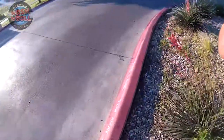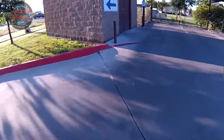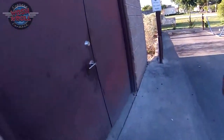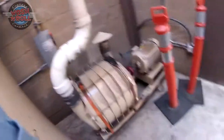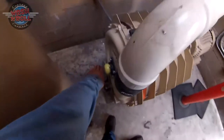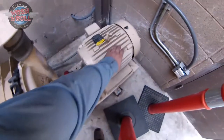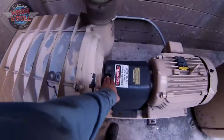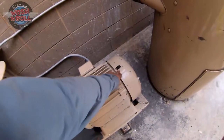Most of the greasing can be done bi-weekly, but this final greasing needs to be done weekly because of how much they run — these are your vacuum turbines. The back bearing on each turbine needs to be greased weekly. This one needs to be greased weekly, and this one needs to be greased weekly. You don't need to grease this one — it's an electrical motor that only needs to be greased yearly on that zert. The two vacuum turbine back bearings on each side need weekly greasing: one, two, and three on your back end. The electrical zert needs to be greased yearly.